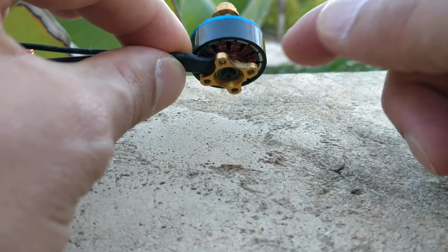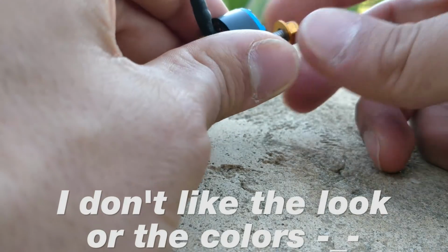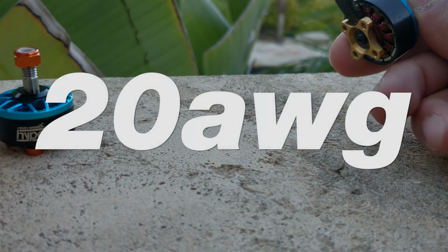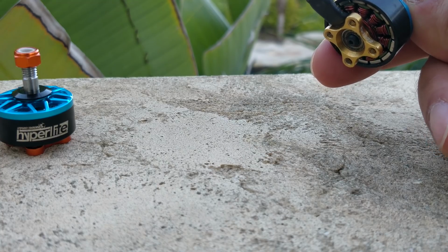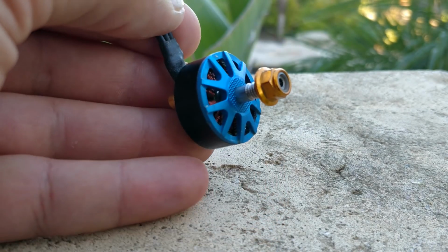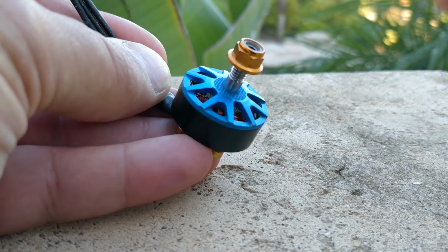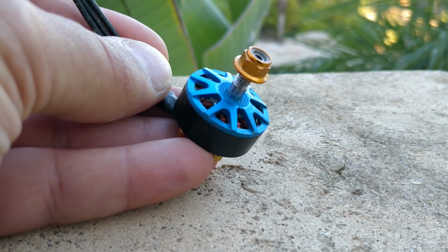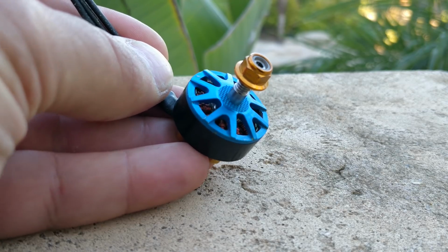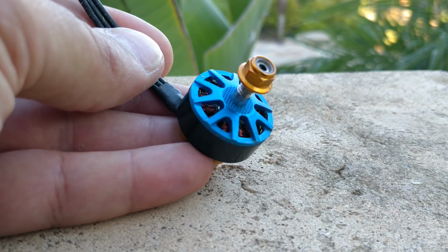16x16 mount, the information of the motor written on the base, nothing really on the bell, and a shaft that's long enough to fit the props on, the whole prop hub with a full-size nut on. I wanted 20mm wires and some other little details inside, 0.15mm laminations and some other details about the stator. Basically, I gave them all the things I could possibly think of that I wanted on a motor, like this grip on the bottom of the prop hub so it doesn't slip, the one that they make, which is really nice. And so they made me that motor, and it's freaking awesome. This is a 1922 kV motor, which is a little bit high for 6S, but like I said, I'm going to talk about that in the next video.